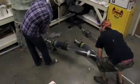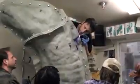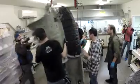We inject from the bottom, and the foam's gonna rise. We put bleeder holes every couple of feet so we can see where we're at as far as material goes. Let that gel, move it to the big oven, cook it for 12 hours overnight, and the next morning we have a dinosaur.